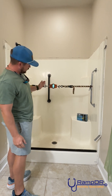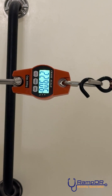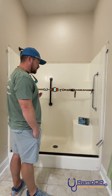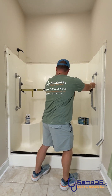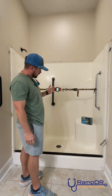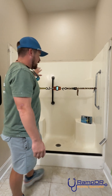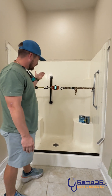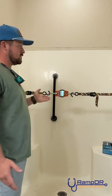All right, we are at 249. We're dropping — I did ratchet it twice. It dropped significantly, about 20 pounds of pressure, but it's still at 229. We're going to ratchet it again — it should push it over that 250 mark. So I just ratcheted it again. It started at 265 and it's dropped. You can hear the cracking on both sides from the Moens and from the toggle bolts. Just from me sitting here talking, we're down to 261. But they made it to the 250 mark, which is honestly very impressive.